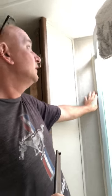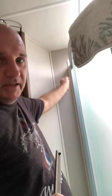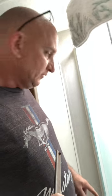What I did was go up top, put my hand through, and feel the vent in the wall. I went to the outward side of the vent and drilled beside it in the wall, then came down and fished the solar wires down and pulled them underneath the shower and down through the floor. I'll show you outside — you can pull a couple of covers off and access the wire underneath.